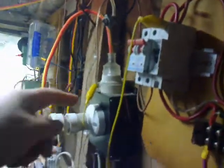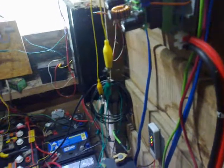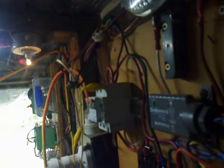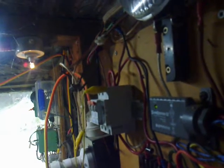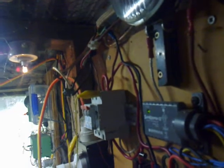There's the wiring there for my infamous 8 volt bank. It's just being fed through this festoon lamp at the moment and the standard silicon rectifier. It's got a couple of shunt regulators actually installed in the battery box across each battery, but more about that when I do something a bit more with it. But it's just keeping those batteries topped up. That's a couple of those big massive 150 amp hour AGMs that I got once from the guy in Palmerston North.